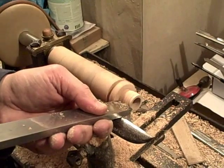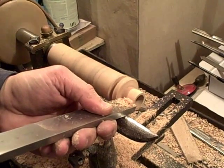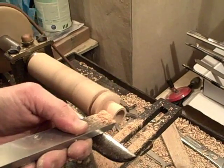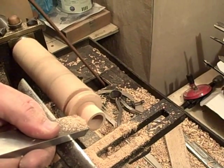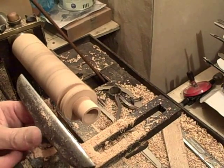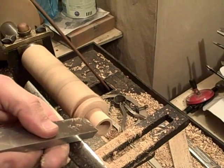Okay, let's put that down here. What this will do is just square it off nicely. I've just sharpened this up nicely, so it's got a lovely little burr on the end there. Scrapers were commonly used in the 17th century, so it gives a nice little effect as well. You can, of course, skew it — make it nice and smooth on there. I'm just going to lift that up a little bit more. It's always nice to have your scraper pointing as far down as you possibly can.